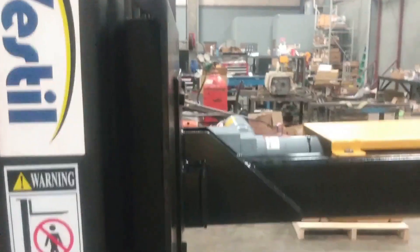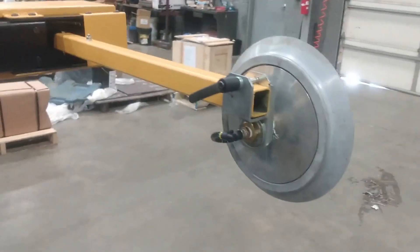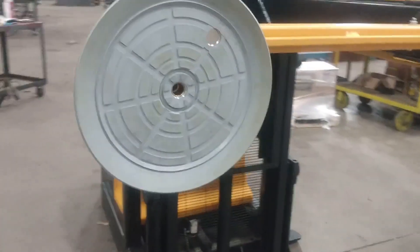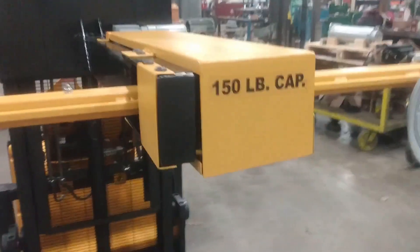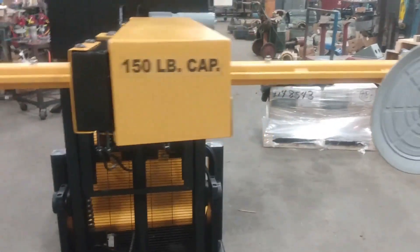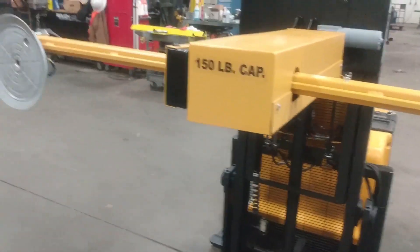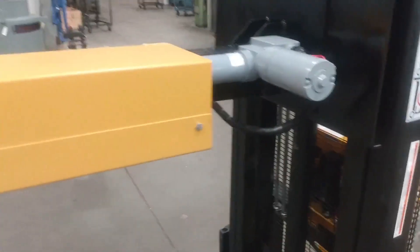Here we added the front mast with the cups and rotation bars. Each vacuum cup will do probably 400 pounds or more. The heaviest sheet we're lifting is 100 pounds, and it's rated at 150. Two cups will handle a 96-inch long by four-foot wide sheet with minimal bending and bowing.